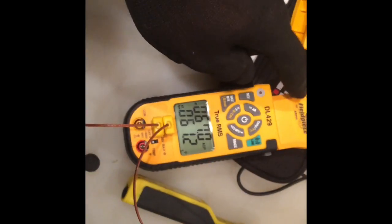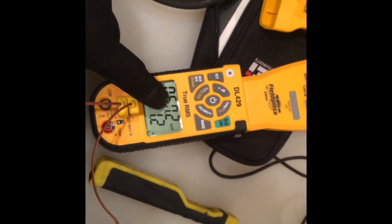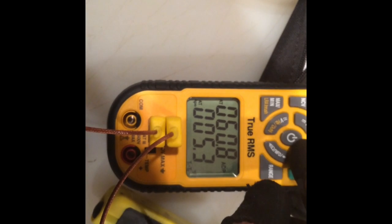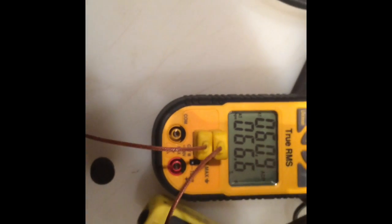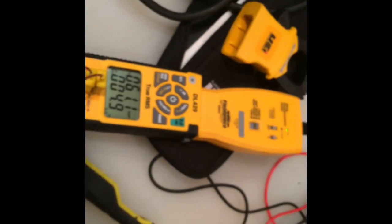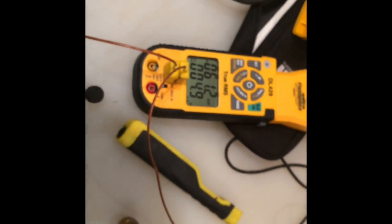Any of the field piece heads will fit on this meter, and it'll display the head at the top and show 'ADP' for adapter. For you guys that do air conditioning, you can get your wet bulb temperature — 60.3 here. Then you can come over and get your split: put the two probes on supply air and return air, hit T1, T2, T1 minus T2 to get your split. Have your wet bulb, be out at your unit doing your thing. You can come up with any combination on this.